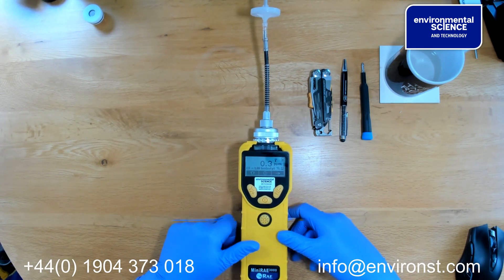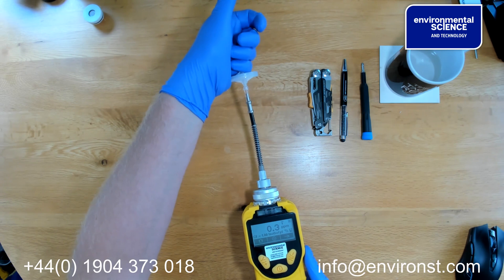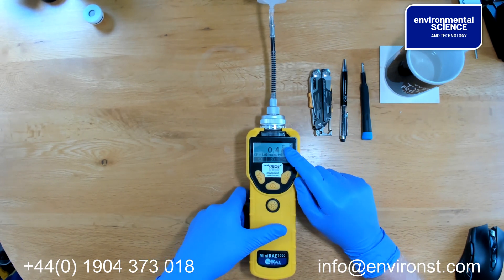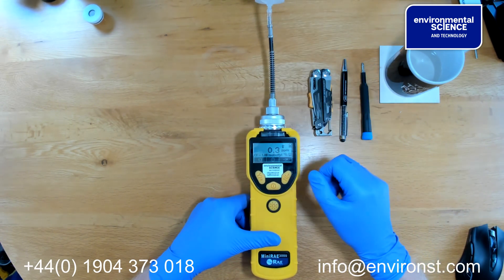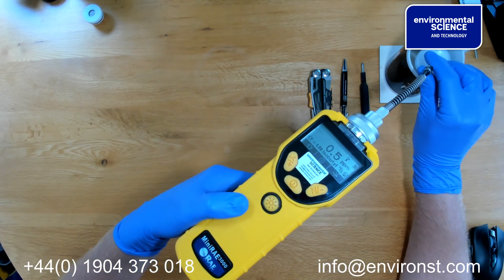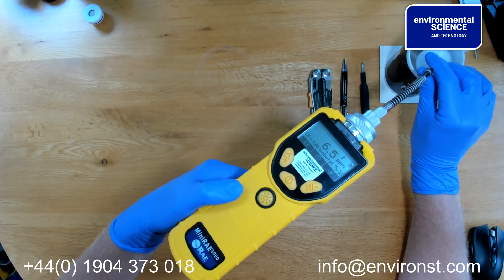Now this can be done in one of two ways. You can either hold your hand, if you have a bare hand, around the end of the probe — not tightly — and the moisture coming off your hand will go into the unit. And if the unit is moisture sensitive, you'll see an increase in reading on or above 2 ppm after 30 seconds of exposure. Seeing as I'm wearing gloves, I have to use the alternative method, which is to expose the unit to a hot drink. So if we expose the unit to a hot drink here, we can see that the steam from the hot drink is causing a significant response on the unit.